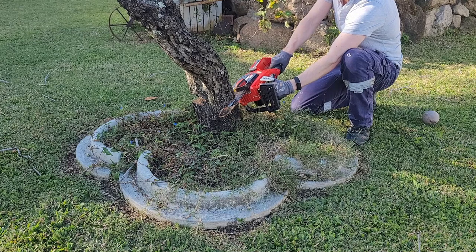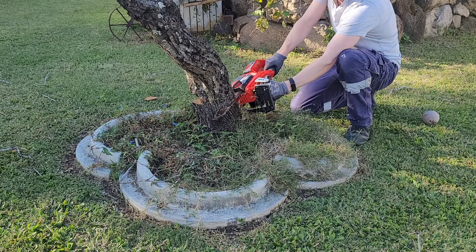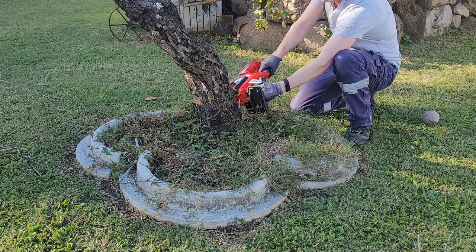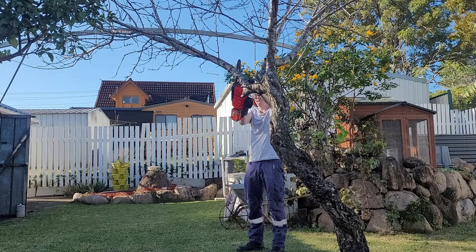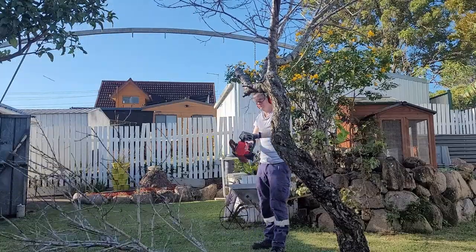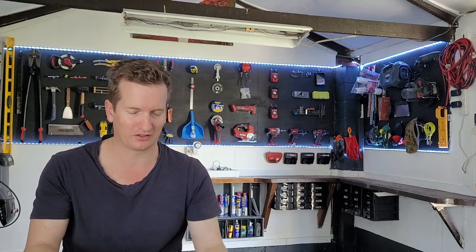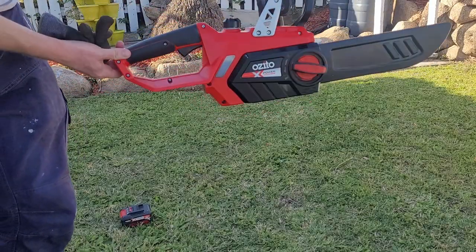What if you're just cutting a log or something already on the ground? With this you don't need to put as much thought into it, but you do need to be mindful of how the piece will fall after you've cut it. Apply a bit of common sense — make sure the piece you're cutting is supported on both sides so you don't get a nasty surprise and have a bit of log fling up. Also, never touch the ground with the chainsaw. It's designed for wood, not soil or grass, and letting soil and grass get into it is basically going to ruin it.